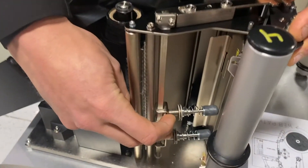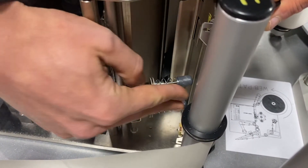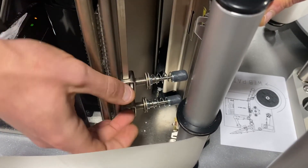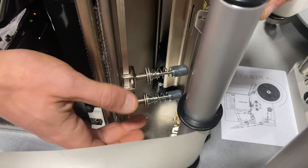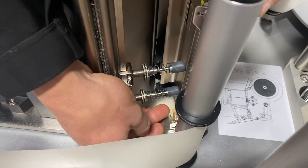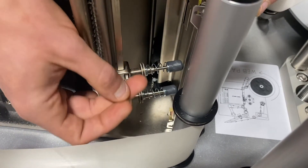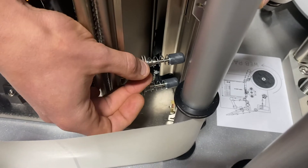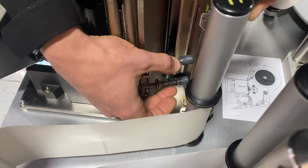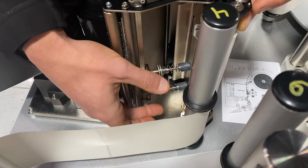Here we've got two what we refer to as toggle feet. They apply pressure and even tension to the printhead onto your label. We can space them out width-wise. When you're spacing these, you want this one to be on the inside bottom edge of your label, roughly a quarter of an inch, and this one to be on the inside top edge of your label, roughly a quarter inch. We want even spacing of these two toggle feet to make sure we have the pressure throughout the entire label and we don't have print quality issues.